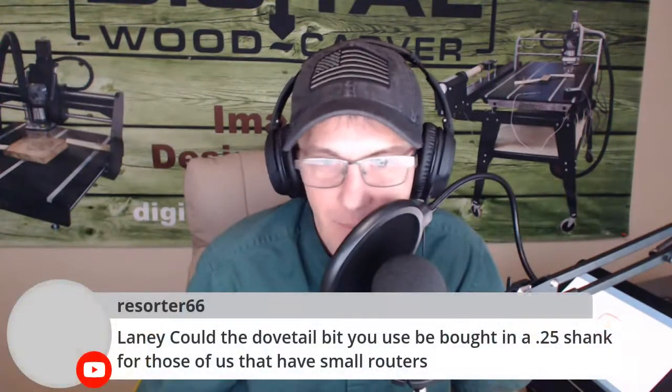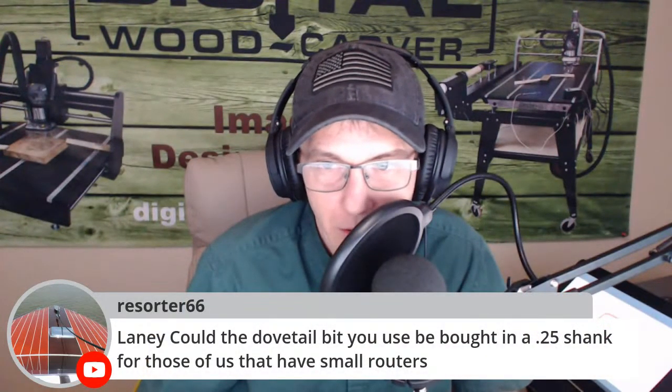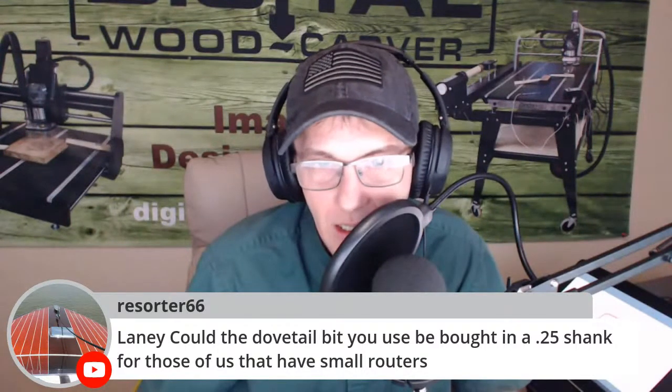All right, let's see here. Already starting off with some questions. Let's jump into a question before we get started in the design. Lainey asks, could the dovetail bit you used be bought in a quarter inch shank for those of us that have smaller routers? I don't know if that particular bit could be bought in a smaller shank, but absolutely, my other dovetail bits are quarter inch shank. The key to that bit is it's a 7-degree dovetail bit with a cutting diameter of 17/32, and dovetail angles come in a lot of different degrees.